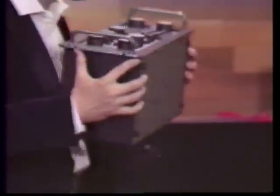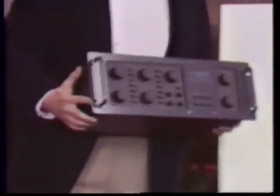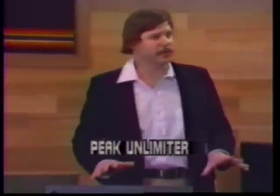that's not the end of it, though. So this preamplifier has given us sonic holography for the front, has given us time delay and a built-in power amplifier for the delayed and the reflected and the reverberant sounds. But still there's something missing, and that's dynamic range. When a recording's made, typically, when a snare drum hits, the recording studio can't possibly put that on the record. So they have a compressor that clamps its level, just momentarily clamps it. But it results in something that's not really like real life. This preamplifier has a peak unlimiter, which in large measure undoes that limiting effect that the recording studios superimposed.